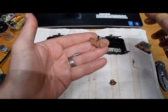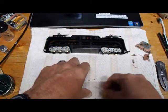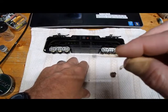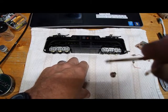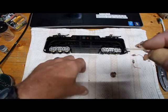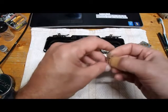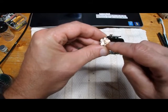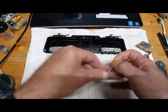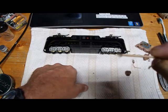This is what's left of the lighting circuit. I replaced it. What caused that burn was, apparently, somebody took one of the springs out for the brush springs and cut it in half. What was happening is the brush wasn't sitting on there the way it should be with enough tension, which caused that to burn. To take an existing spring and cut it in half and try to make that work — that is not going to work.